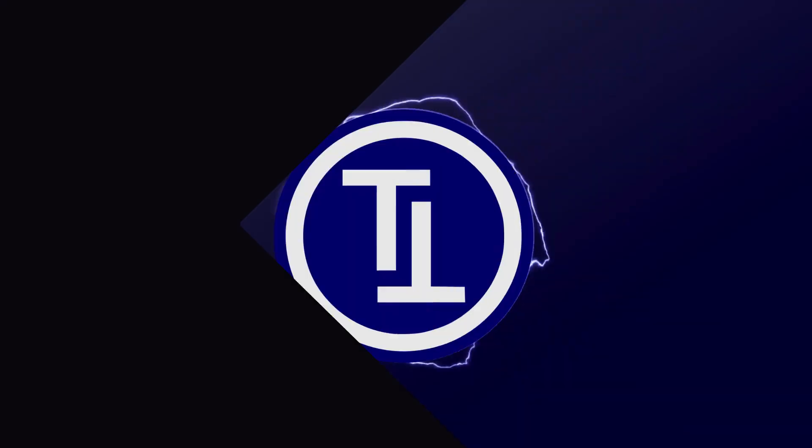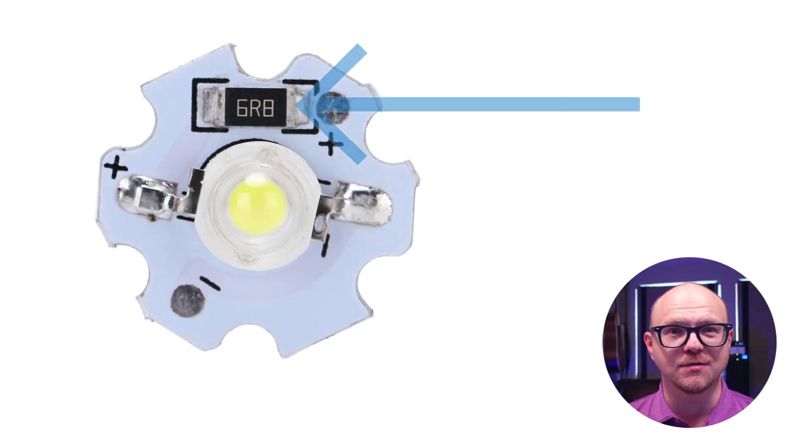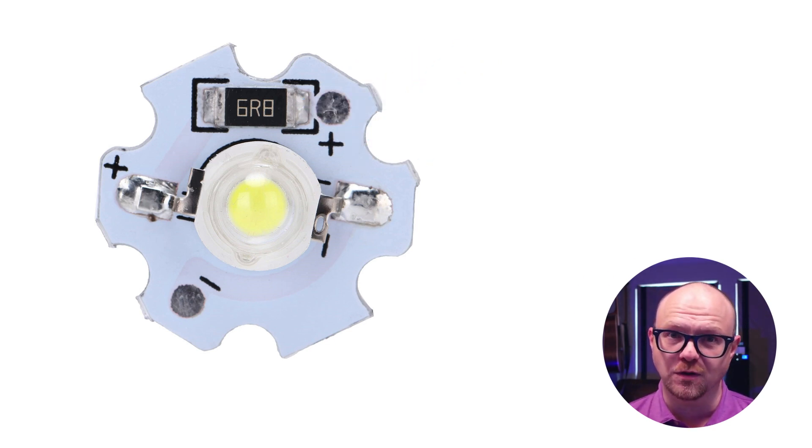All the components used have links to TerrainTronics and Amazon listings in the description. The most you'll need is a wire wrapping tool and a soldering iron. These 1 watt cold white LEDs from Amazon are perfect for the job — they provide almost 20 times more light and already have a current limiting resistor on them, so you get maximum power when you drive them with a 5 volt source.